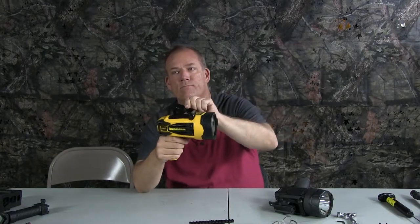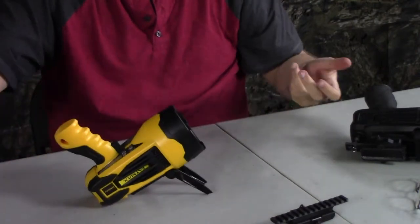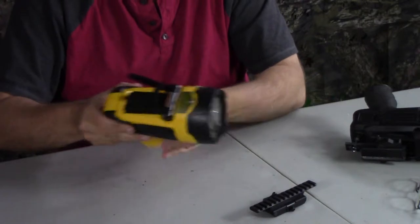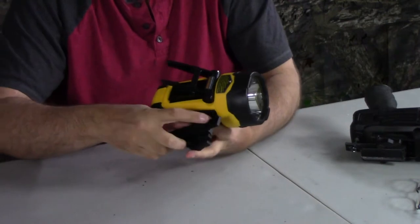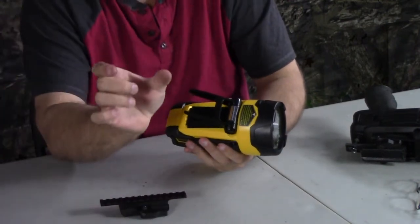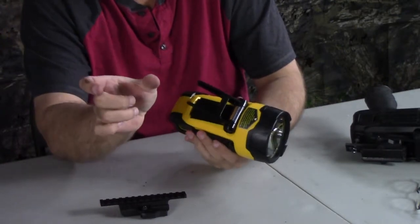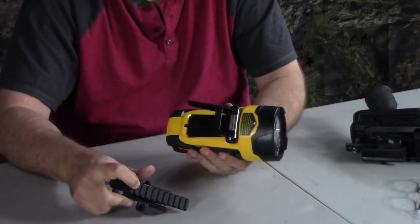The Stanley also has this attachment here — it's a little kickstand thing. That's what we used to mount it. Took the quick release mount, took off one edge of it, made it flat, put a hole through here and here, took pieces of steel — circular steel, kind of like metal doweling — and cut a couple-inch piece that we ground in the proper spot to match here.